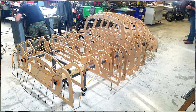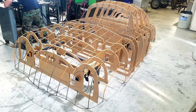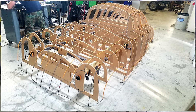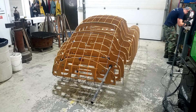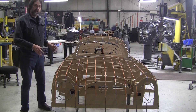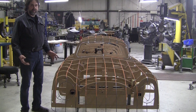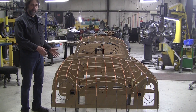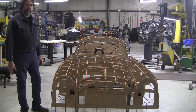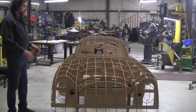Ken's taken a different tack — he's building the chassis, which is all made with 18 gauge sheet metal all bent up, and Spencer wanted to make the body first. You can do it either way. Spencer's approach was at the class, he saw the advantages and disadvantages of a wire form. The big problem everybody wrestles with is: okay, I understand the wire form, but how do you bend the wires to make it look like a Porsche? He was a little intimidated by that, and was more into the technology and CAD files. You can't scan a Gmund Porsche because there are so few of them available, so you have to rely on photographs to gather information to reproduce that shape.